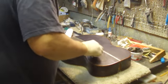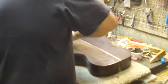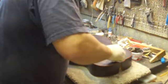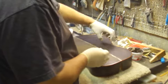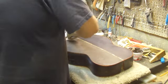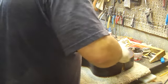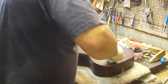Now, I've tried water-based grain filler. I've tried epoxies. With the water-based stuff, I always had an issue with, once I sanded it, it always seemed to leave hazy spots. I called them ghosts. I was doing everything I could to sand it off as well as possible, but it just seemed like I never got it exactly the way that I wanted it.